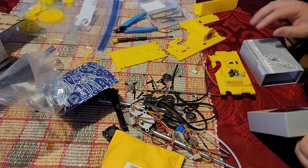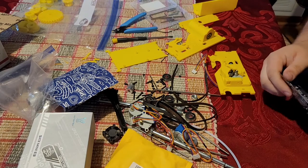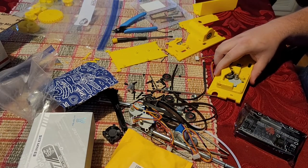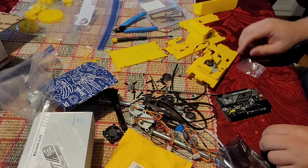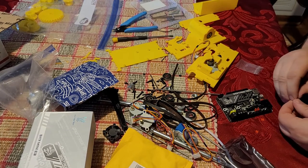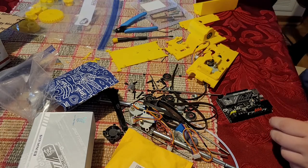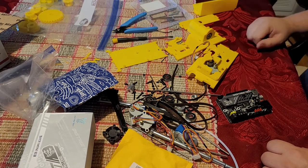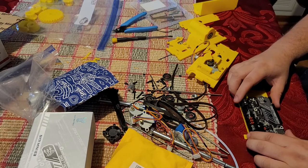Take your control board. There should be screws going through here and a 10mm screw in here, which helps reinforce the plastic, keeping it from creeping over time. On the control board, I'm going to put jumpers on the X, Y, and Z diag. That will enable sensorless homing so that we don't have to worry about end stops. If you don't put those jumpers on, sensorless homing will not work and your printer will never home.